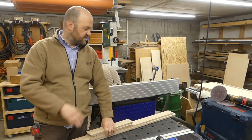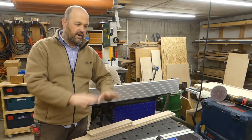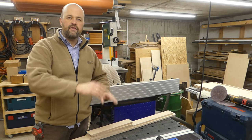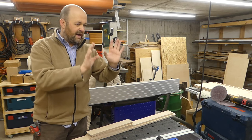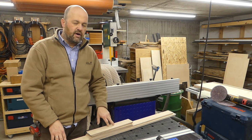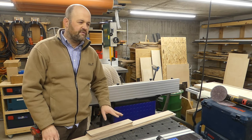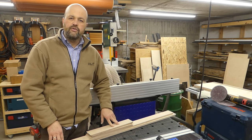and then drill some pocket holes to attach them to the bottom of the carcass. And I think it's better to do this before I do the glue up, because then both things can dry, and while the carcass sits on the workbench, that is occupied, so it's better to do the small thing first, which I can move away then for glue drying, and then do the glue up on the carcass.